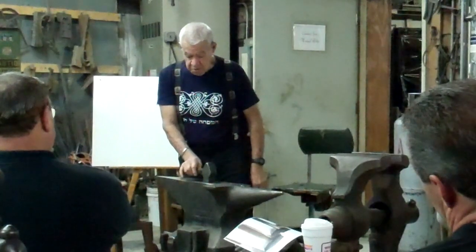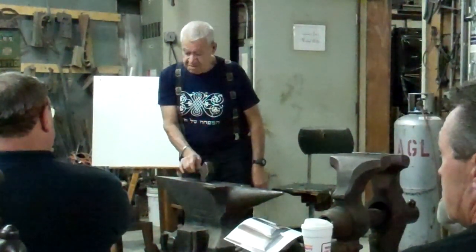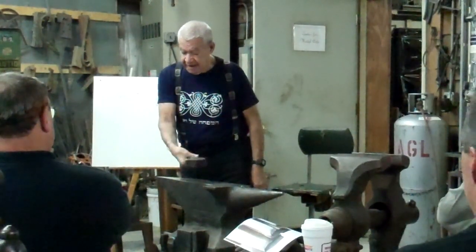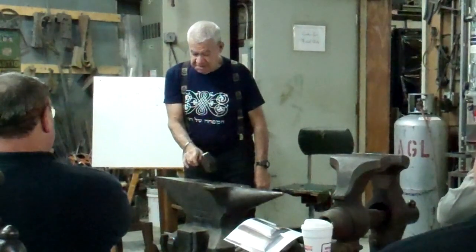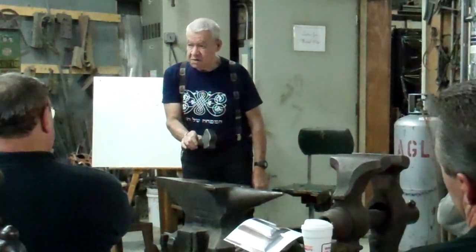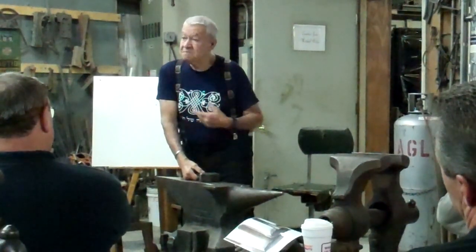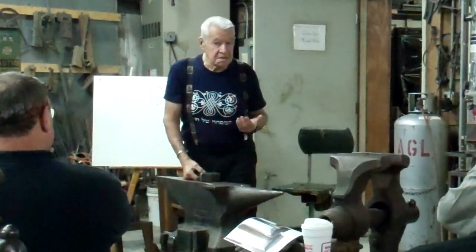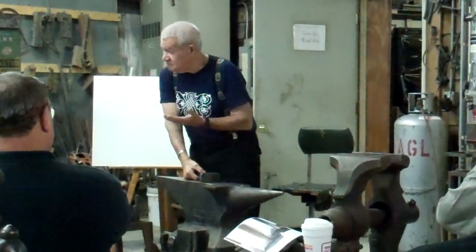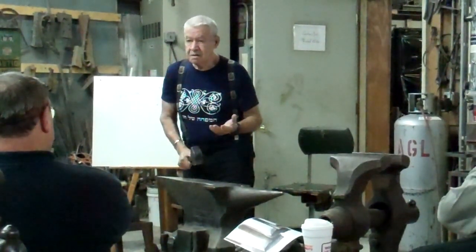And the hammer is all the time moving in the hand like this, between the fingers. We don't have to move the hand because we don't hold the hammer in the hand. We hold the hammer like this and we move the hammer between the fingers. If the hammer is balanced, you don't have to hold the hammer. We are guiding the hammer. Philosophically, it's a big difference between holding the hammer and guiding the hammer. Okay?